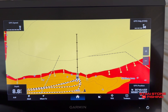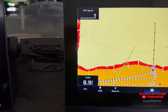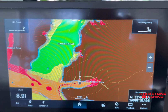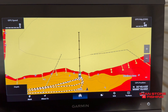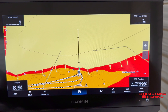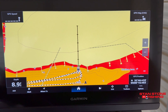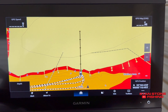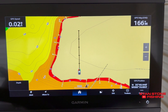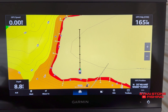Now that we've got the SD card with the update file on it, you want to make sure you turn the power to all your units on. If they're networked, when you turn one on they will all come on. You want to make sure everything is on because this update updates everything on the network — whatever Garmin devices you have. The only thing it does not update is the trolling motor, the Force — you've got to do that separately. After everything's powered on and all the units are on, you just want to insert the SD card.